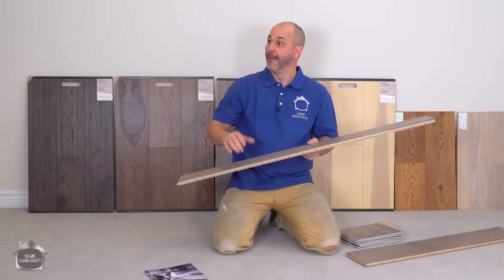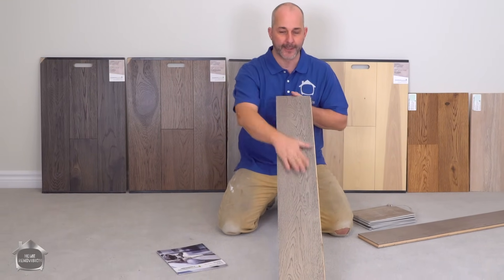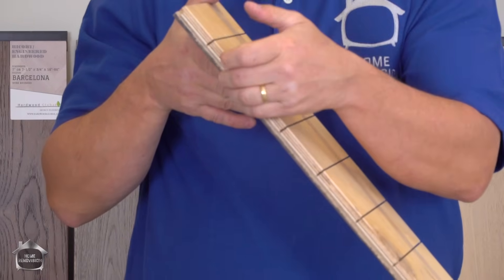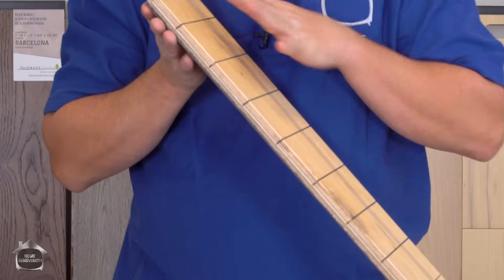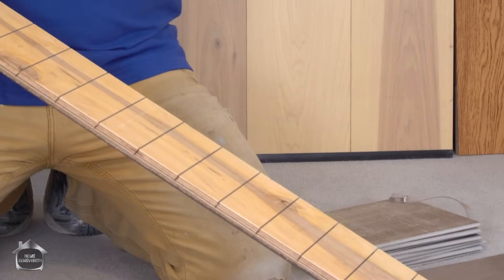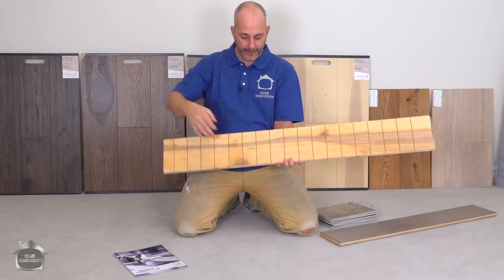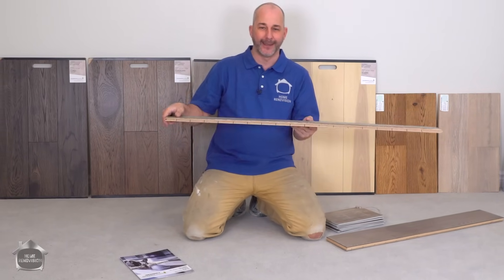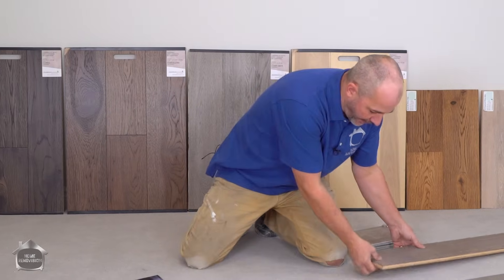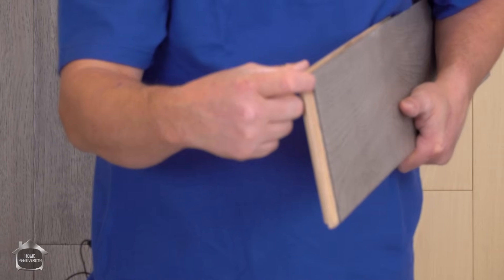What we're installing upstairs is engineered hardwood. The benefit over regular hardwood is that it's still hardwood, but because it's engineered it's built on layers — layers of different plywood that give it strength and keep it from warping. With regular hardwood you pay a real premium to get wood that isn't warped; with engineered hardwood you don't have that waste, so it keeps the cost down. It also has a nice kerf line in the bottom which makes it a bit more flexible for installing in older homes.